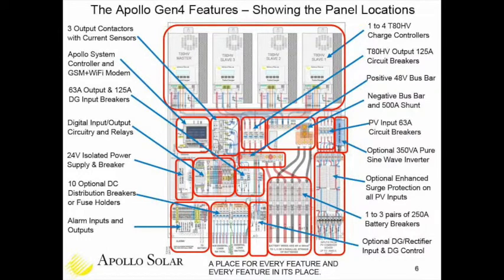Slide six has an assembly drawing showing the location of all parts on the panel inside our cabinet. This is for reference — it shows red boxes surrounding each separate electrical function on the panel, with functions labeled so you can find where different things are happening. Every panel we produce is the same to the greatest extent possible. If features are not required, they're simply absent from their place on the panel. There's a place for every feature and every feature is in its place.